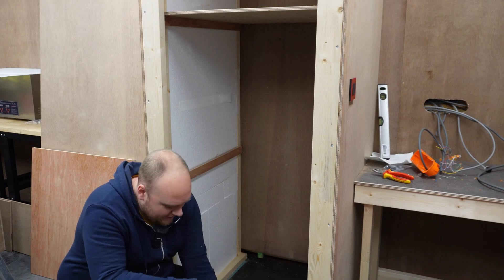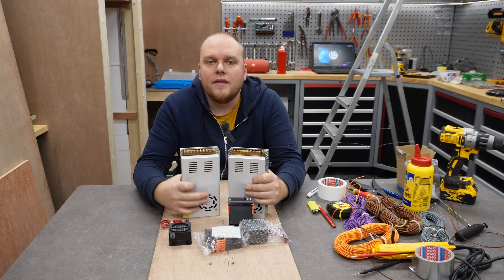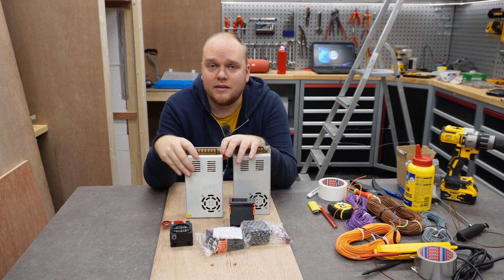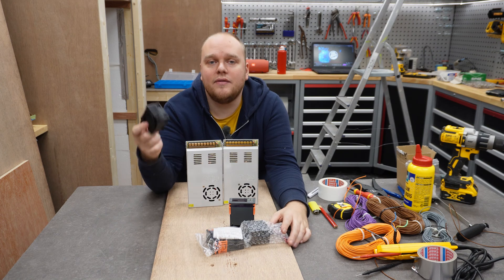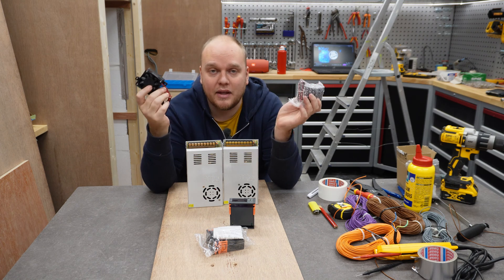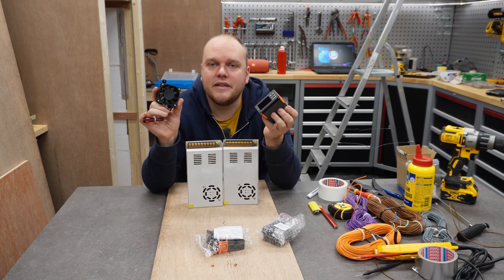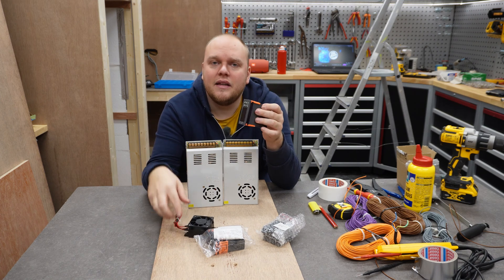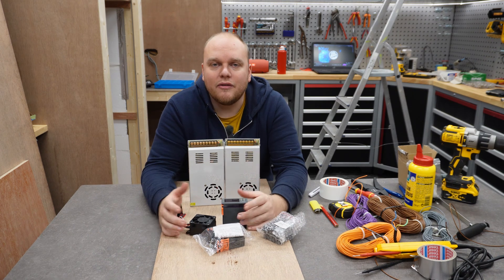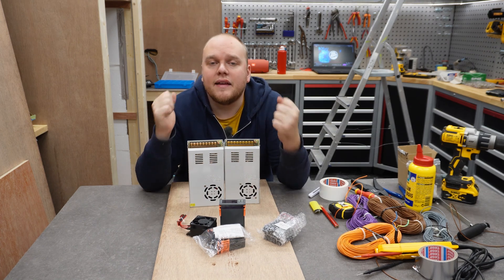It's pretty difficult to put in, but it's ready. Let's turn it on. Nice. Next up we have these — these are two 24 volt power supplies and they are going to power the LED strip inside of the enclosure. We have the two heating elements to make the chamber of the printer heated so we can print ABS and whatever we want. And we have these controllers, and these are going to be set up in combination with the heaters so we can set a temperature we want — not only in the printer chamber but in the chamber upstairs where all the filament will be stored. To keep out the moisture. So let's mount this all on this board, get it in the chamber and get everything wired up.